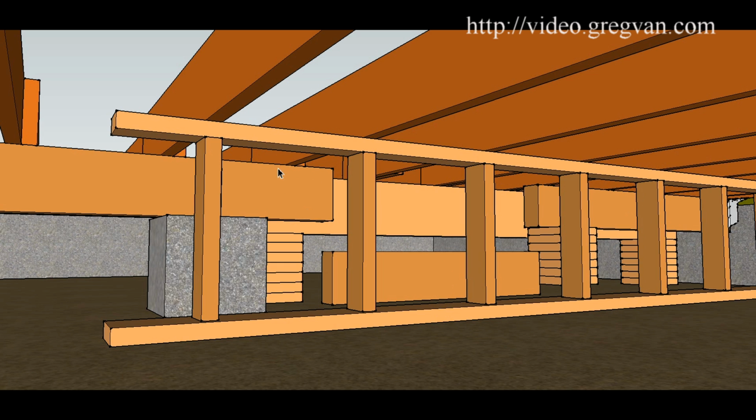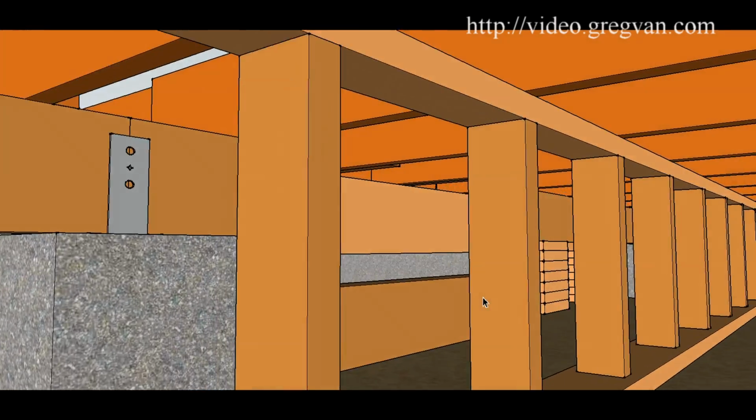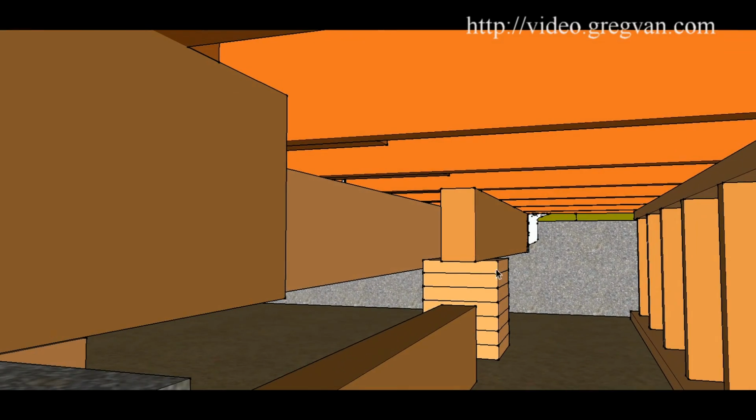So remember, at this point, you are no longer attached to the joists, and the beams aren't going to be supported by anything once you cut them. So it wouldn't be a bad idea to install some blocks. You could put a jack underneath it if you're planning on lowering it with a jack, but that could create an unstable situation. I would suggest using the blocks.